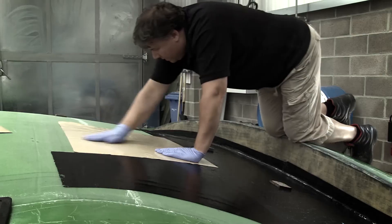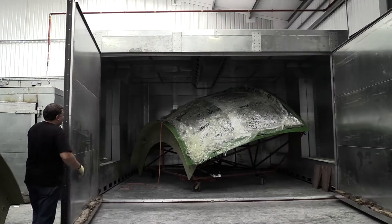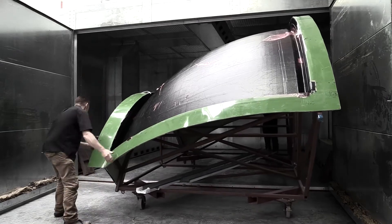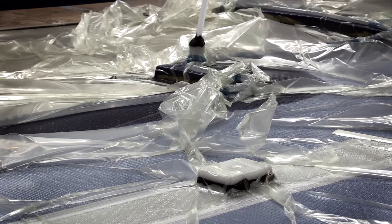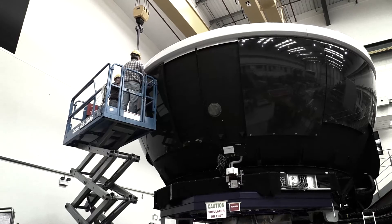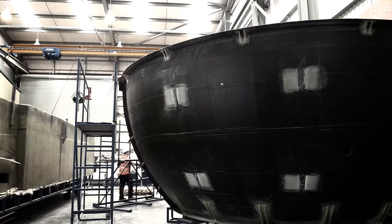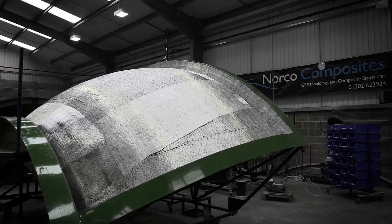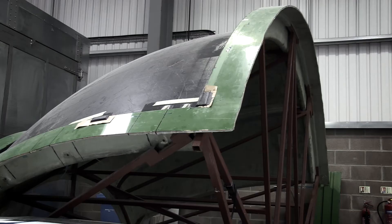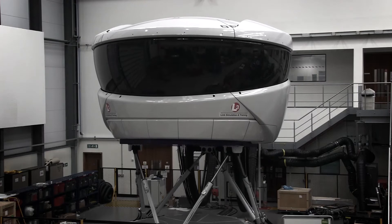The three primary structures which make up the visual surfaces are the two pieces of the plenum and the hood. These are laminated using low-temperature pre-preg technology and cured in the large curing oven at Site D. The upper hood canopy is produced using a combination of vacuum infusion and pre-preg processes to balance cost and weight. The 20 square meter bowl, spanning 5 meters and supporting the entire visual system, weighs in at just 135 kilograms, achievable only by using a combination of unidirectional carbon and glass fiber pre-preg combined with a lightweight foam core.